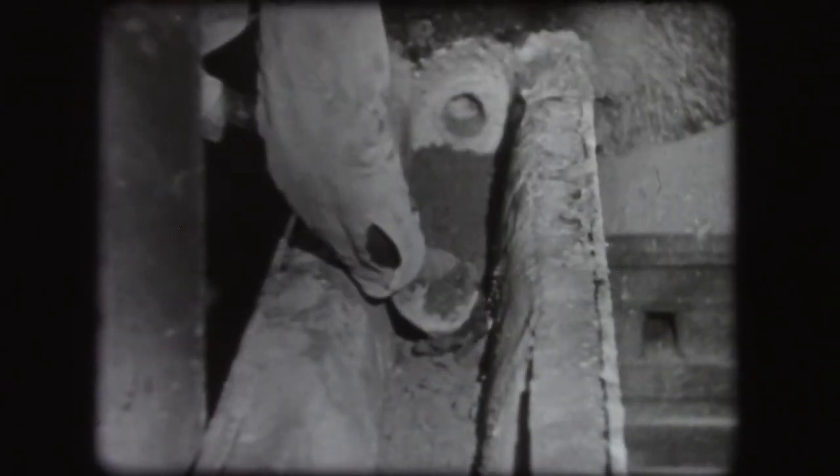The tap hole is built up in a similar fashion. But in the case of the tap hole, a quantity of ground-up fire brick is used to ensure a more heat-resistant lining. After the material is tamped firmly in place, carefully remove the pipe. Then cover the material with clay wash. The remainder of the breast is then filled with daub and the tap hole finished in the same way as the slag hole. After the sides of the tap spout are covered with daub, the bottom of the spout is lined with a specially prepared mixture containing a high percentage of fire sand.